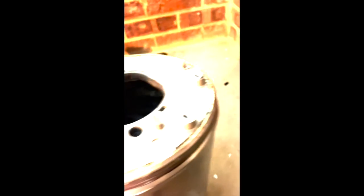When we see the leak around the top, the red burner gasket isn't really going to do anything, unfortunately — it needs a new heat exchanger. Which, if you look at my previous videos, actually isn't that hard to change. You're probably looking at an hour and a half, two hours labour maybe, once you've done a few. Saves the customer a couple of grand.